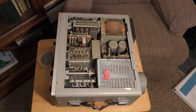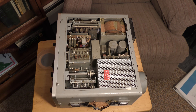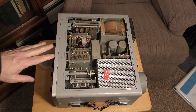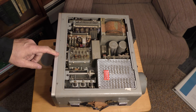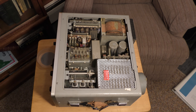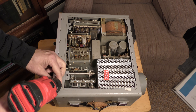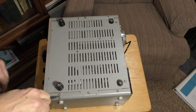In general, this transceiver is in pretty good shape. If it had been put in a place with high humidity, you would see a lot of damage. Before we think about the boards, we need to take it out of the case for closer inspection and then gently get the boards out. I'm not seeing too much surface corrosion — mostly just dirt and dust. That's a good sign. Now I'm just going to get the screws out. Looks like we have some hex heads.